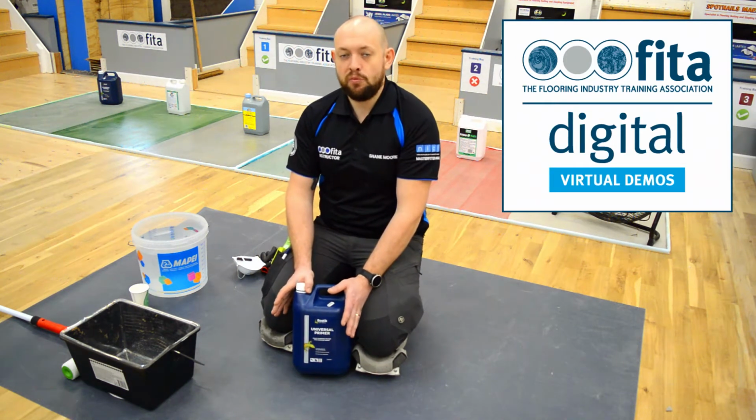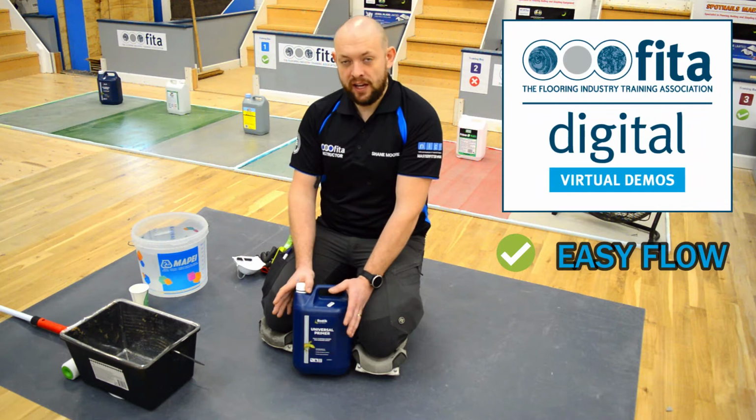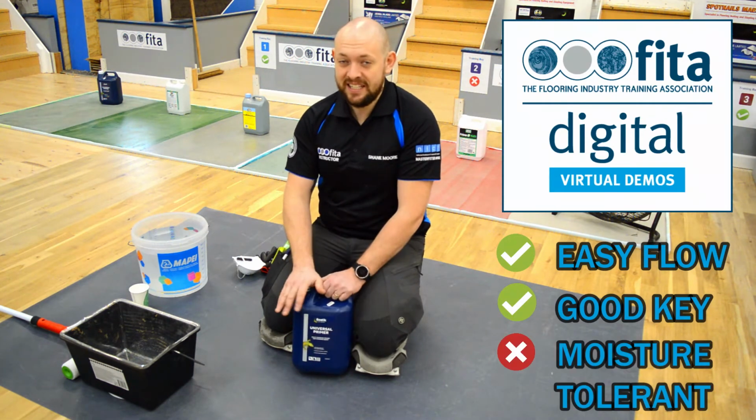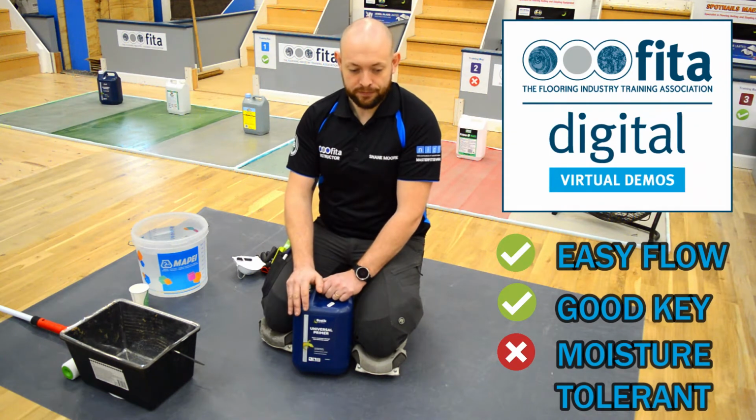So the reasons why we prime the floor is to allow easy flow of the smoothing compound and gives it a good key. This is not moisture tolerant.